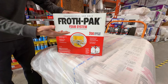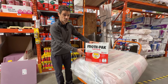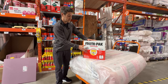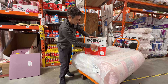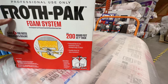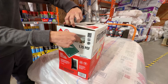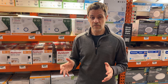There are strict instructions for when and where to use this — it's okay for residential construction but not most commercial construction due to fire regulations. It gives you another option for insulating and air sealing difficult spaces. This kit covers up to 25mm thick over about 20 square meters, so several kits could insulate your entire crawl space floor, making a cold floor into a warm floor. It comes in two pressurized containers at the correct mixing ratio.